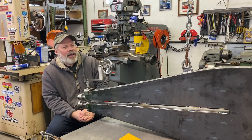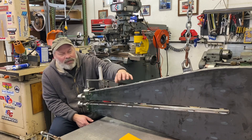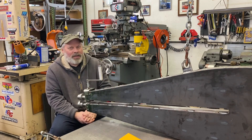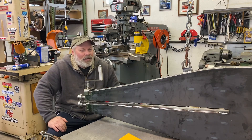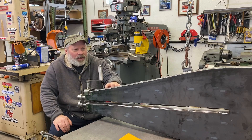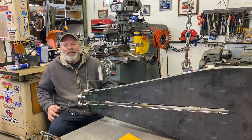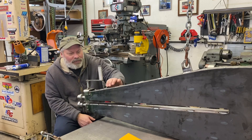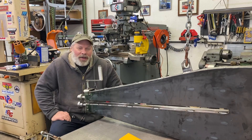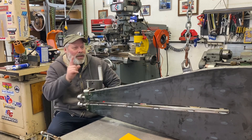Thursday night I attacked the top skin — the rib in the middle, the finished layer on the outside. This was the funnest part of the whole project. Unfortunately, I had nudged the wire speed setting on the welder and these spot welds are not as pretty as the bottom. The bottom where you can't see it is really nice. These are fine, but I'm going to look at that for the rest of my days wishing I'd done better. When I put enough paint on it, it'll be fine — I'm just really picky.